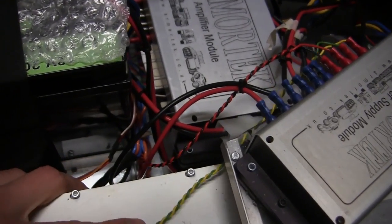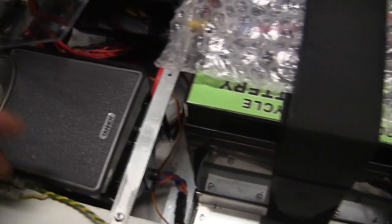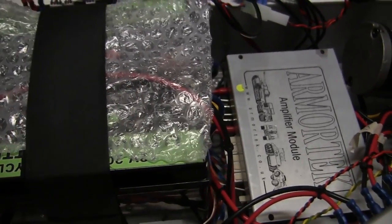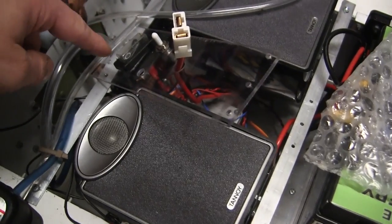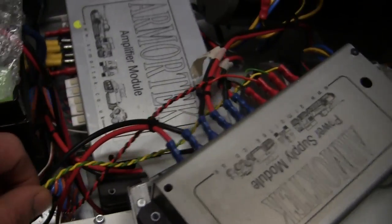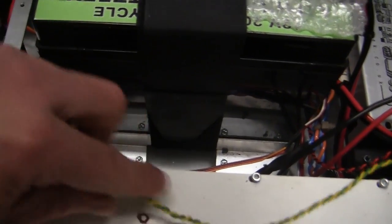One modification I made with the wiring is that I replaced the stock wires on the speakers with new wire from another source. The reason is not because the stock wiring quality was bad, but due to the spread of where the equipment is laid out, the stock wiring was not going to be long enough to wrap around the batteries to get to the amplifier module. New longer wiring was added in its place. The old wiring was recycled and utilized for connecting the smoke system, since the smoke system in the rear and the power supply mounted at the front meant the stock wiring was not nearly long enough to connect the two components. The wire runs along the sponson and will be tidied up by the next video update.